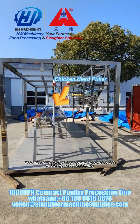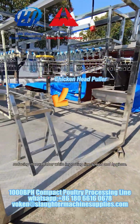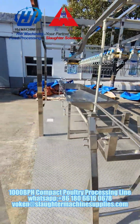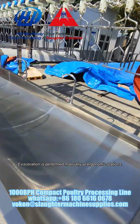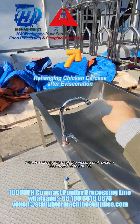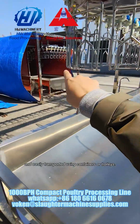The automatic chicken head puller removes heads efficiently and consistently, reducing manual labor while improving line speed and hygiene. Evisceration is performed manually at ergonomic stations. Offal is collected through the viscera tank system, discharged at the outlet, and easily transported using containers or trolleys.